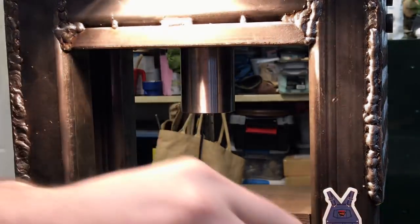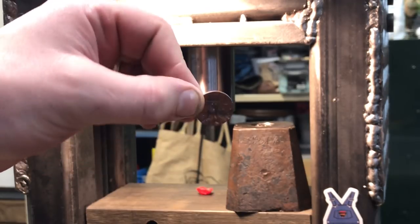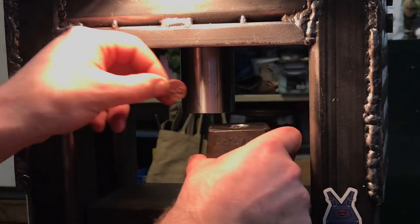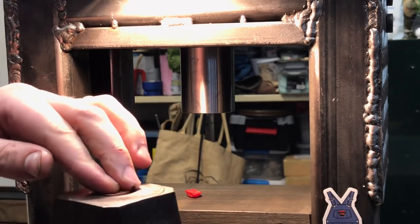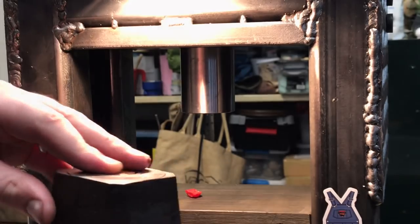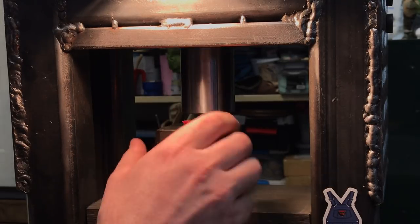That's the first pressing. I'll zoom out, pop the penny out, and that's our first result. I'll anneal off camera, make it nice and red, then come back and realign the penny in the die for another pressing. You can rotate it around a couple times and press, just to show variation. I'm going to re-align the penny in the die so that it indexes. There we go — we're indexed. Throw the urethane back on top, put the die back in. I've aligned it differently — we had our numbers forward, now I'll align it to the side — and push the urethane around a little bit.